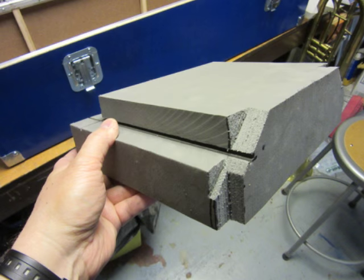I like to use a 3-inch thickness of foam at each end of the case because I'm trying to get a couple of inches clearance minimum between the case wall and the instrument. And with this semi-monocoque frame structure, I've got an inch of depth lost right in the frame that the instrument can't occupy. So 2 inches of clearance plus the extra inch that fits in between the stringers of the case structure gives me exactly what I need in this instance. I start carefully reducing the basic block of foam to fit in between the wood stringers and other obstructions in the case and still have a shape that will support the bell of the instrument.